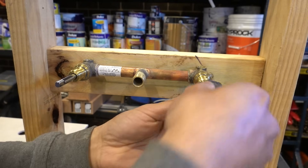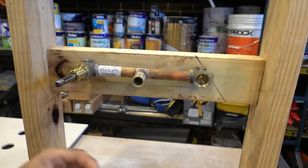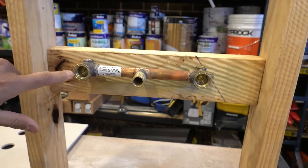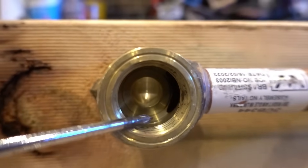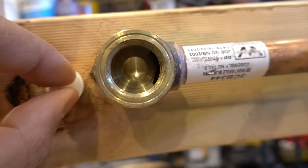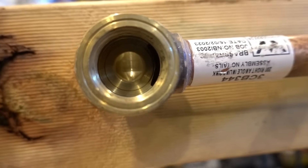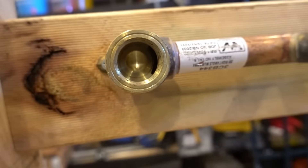Once again we're going to remove the spindles. Once the washer is removed we can put everything to the side and look at the back where the seat is. Looking straight down the back, what we're looking for is that ring that runs all the way around on the inside — that's what our washer sits up against. It creates a seal and prevents the water from coming out; that's how you turn off your tap. The vast majority of times it's going to be dark with some gunk, and it might have damage ranging from light scratches all the way to a little crack or scar that runs across it. That's going to prevent your tap from sealing and that's why it continuously drips.